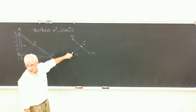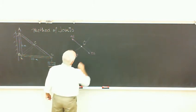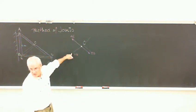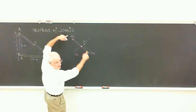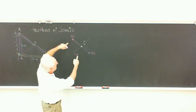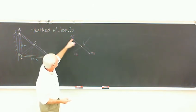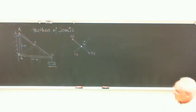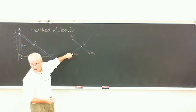What's going to cancel that force? What if I did this with my axes? What if I laid them right along here, and I could do that? What's available to cancel this force? Nothing. There's no transverse component. It may have a little bit of component in that direction, but we can take care of that with the relative sizes of those two. But there's going to be some component perpendicular to this line that has no other component in the problem to cancel it. Which means, what must be true about this force? It's a zero force member.